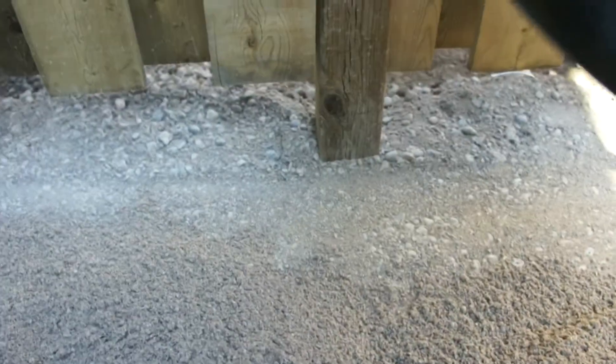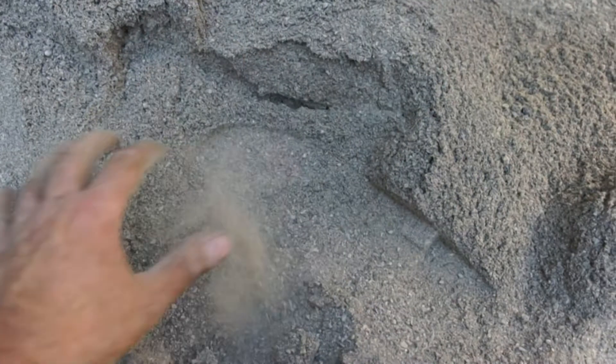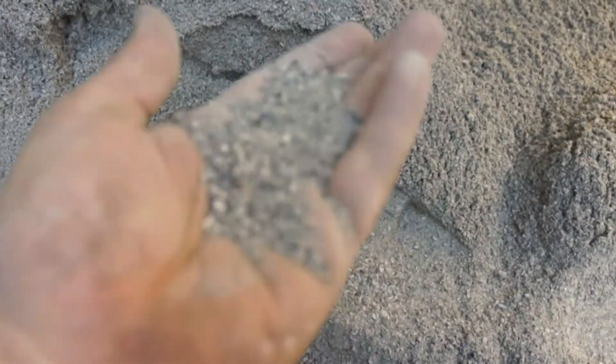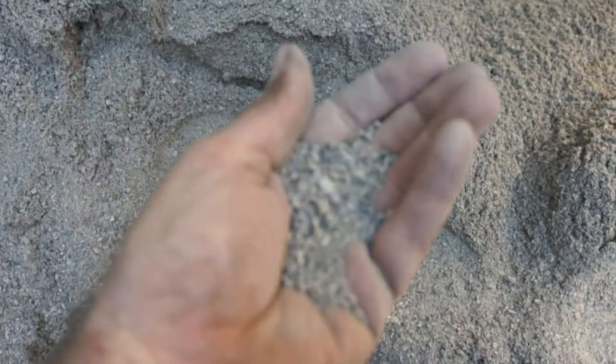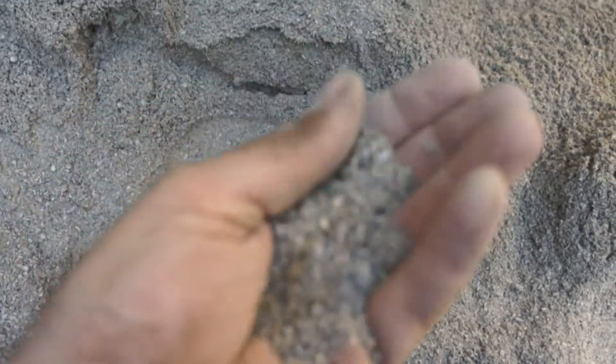The base here is granulary. And one inch sharp sand — see how coarse it is. Not brick sand or beach sand; it has to be coarse or sharp. See, it's got the larger particles in it. That's sharp sand, or what we would call in this area concrete sand.